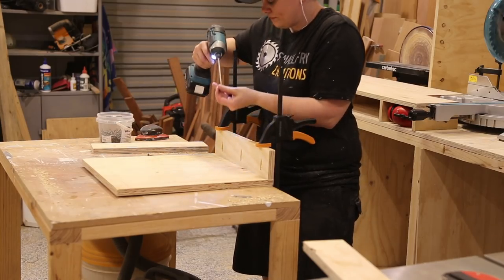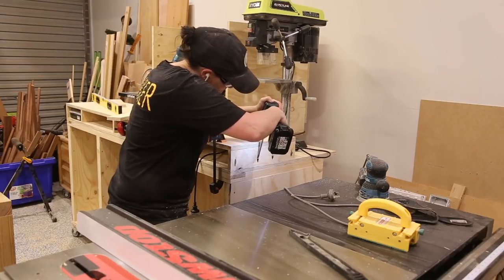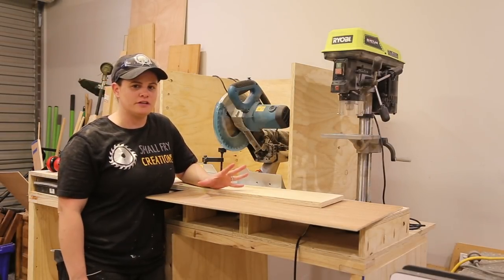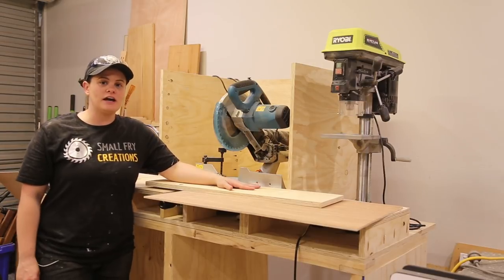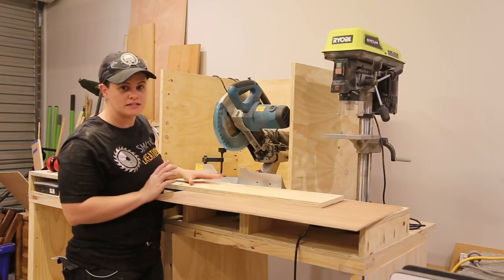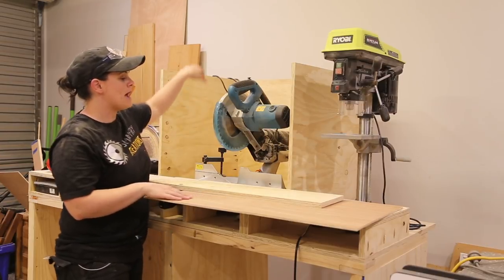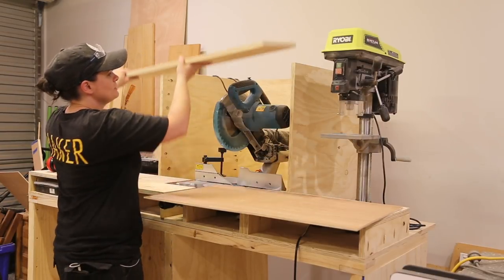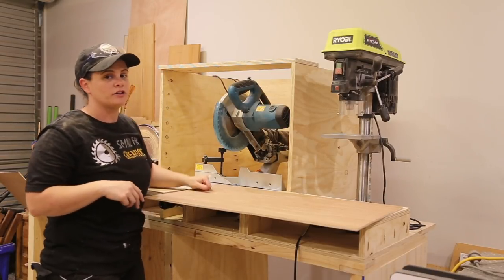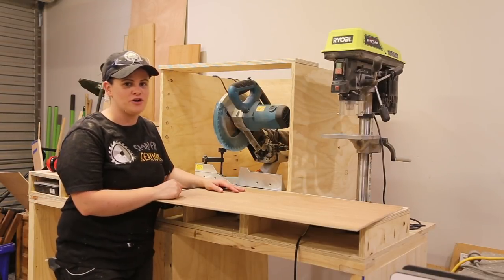The other side of the saw is made of two sections, which allows a section to be easily removed when making miter cuts. Construction was exactly the same as the first side. I want to cut in and mention one of the challenges I faced: I didn't want to get an entire extra sheet of plywood just for the top plate of the miter saw. All I need to do is box it in to keep all the dust in one spot. I used a 6mm piece of scrap plywood at the back and a 19mm piece across the front, which saves an entire sheet and uses up workshop scraps.